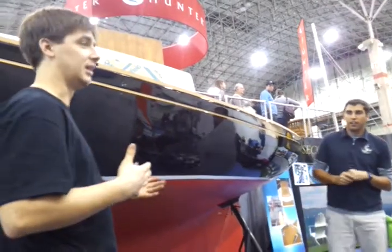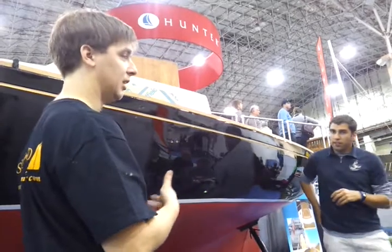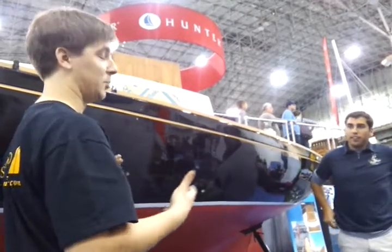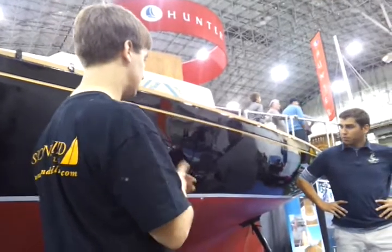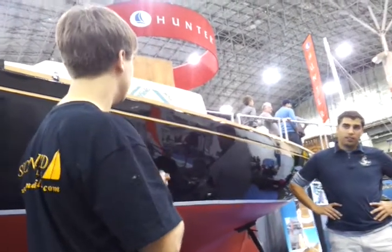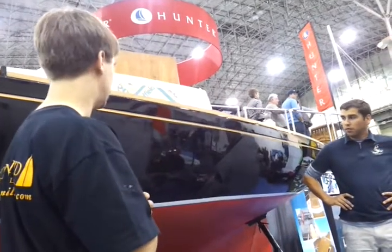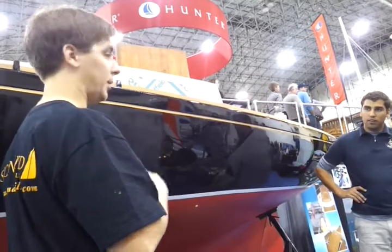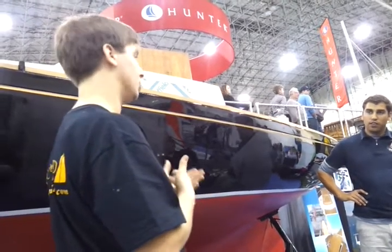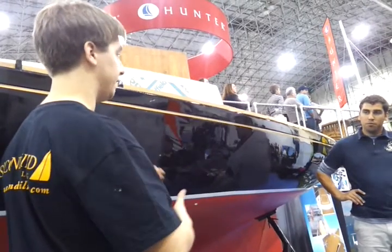Okay, at Second Wind Sailing, we restore classic sailboats. So this is a 1973. Obviously, the boat had been painted a few times, so I sanded down all the paint to get myself to a known substrate, prime paint. This boat's probably about 50% complete, but we're going to show how a new product called Allcraft 2000 is repairable in the same fashion you repair gel coat. So we're just trying to show you about maintaining a finish.